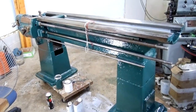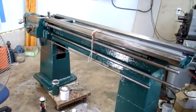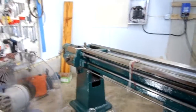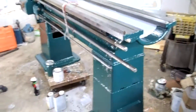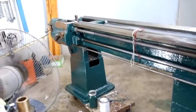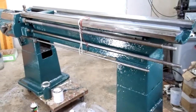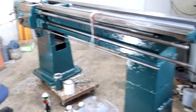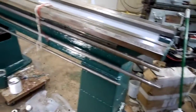You really don't need a lot of power with these lathes. I'm going to do some experiments. I'm ultimately going to try to get it to turn 1,000 RPM, but they really weren't designed for that. I think, I don't know, 4, 5, 6, 700 RPM for these, depending on the swing of the Hendeys. There's information out there on it, but I'd like your opinion from somebody that is a little bit smarter than I am, on what they think about running a 1.75 on this lathe. The lathe came with a 2 horsepower Westinghouse, but 2 horsepower back then was like 5 horsepower today. So they didn't play. This thing was good to go. It would turn whatever the belt would stand.